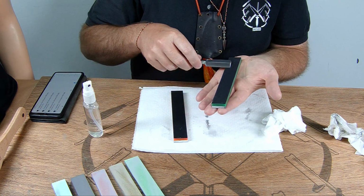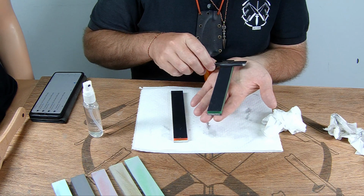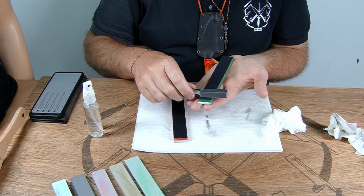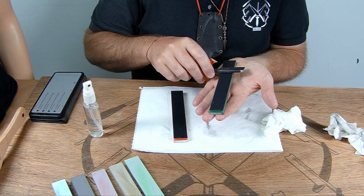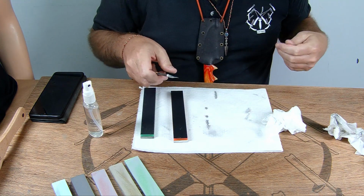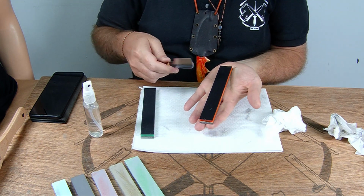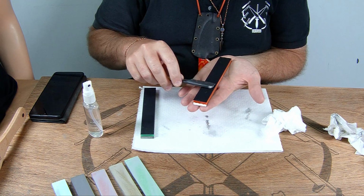Okay, we're not trying to establish 1/4 micron. What we're trying to do is get the 1/4 micron into the 1.2 micron or whatever 1.5 micron 10K scratches. With the .025, it just boom, everything just suddenly starts popping off. So .025 is the orange in color, and here again, just do 5 or 10 strokes, same thing.